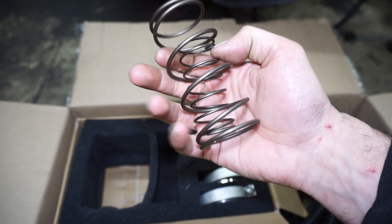The one thing I'm going to change is the flange is a little bit small — the outer diameter of the pipe matches the OD of the flange. So I'm going to put this on the lathe and smooth this transition out a little bit so it fits better and isn't hitting a wall going in. Here's the new piece compared to the old piece — you can see it's just a nice smooth transition in. It doesn't have the little step in it anymore. The outer diameter is about the thickness of the pipe and it has a nice smooth transition.